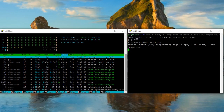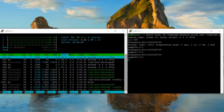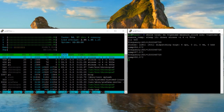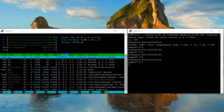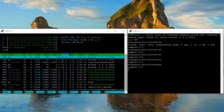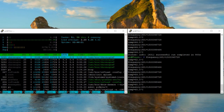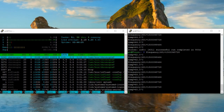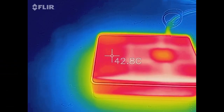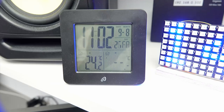Now the Pi in the FLIRC case. Its CPUs also work hard and the temperature starts to increase, but because it has much more thermal reserves, no throttling appears. I ran the test for the full 900 seconds — 15 minutes. The CPU temperature settled at around 64 degrees and no throttling was necessary. The case itself had roughly the same surface temperature as in test one. The room temperature during the tests was about 24 degrees.